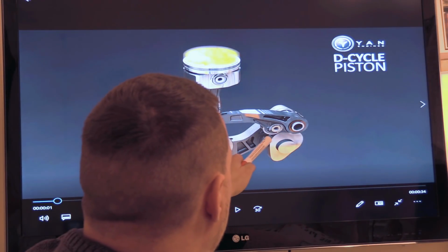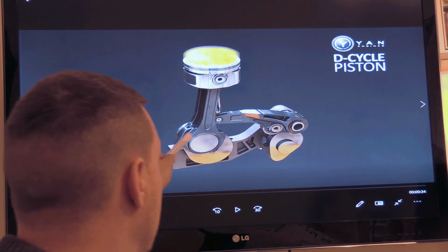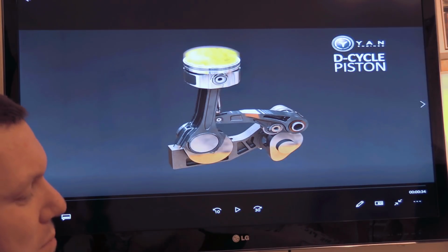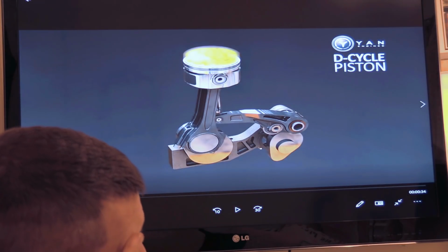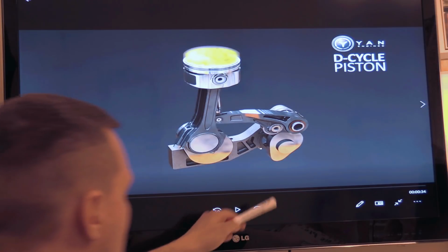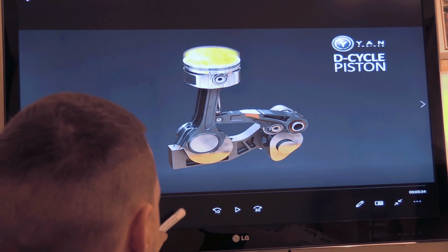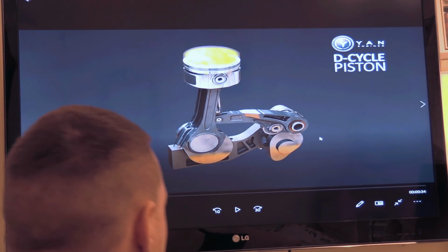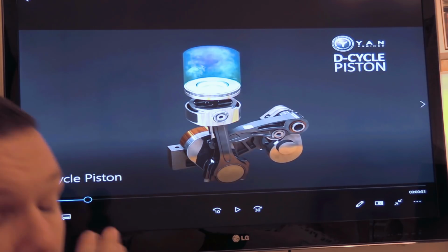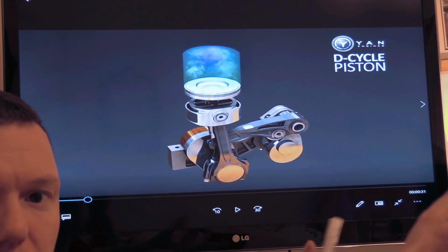So your main thing is you've got 2 separate pistons. You've got a rod that's not split into two, it looks like one complete rod, but it's got 2 main beams with 1 major cap. It's kind of like a fork rod, but not, they go straight up, and for a good reason. A camshaft and a bearing. And if we actually look, one of the first things I want to do is get in my mind exactly how everything's working. So looking at it, the camshaft and the crank are rotating at the same speed, but they are basically geared, so they're alternate rotations.